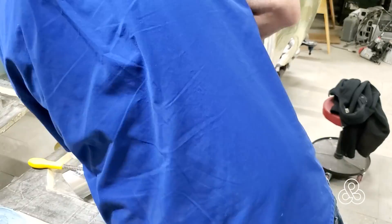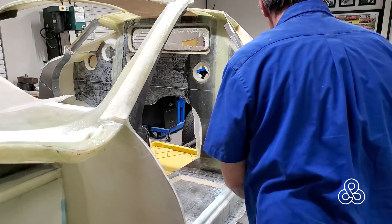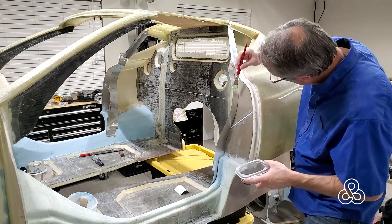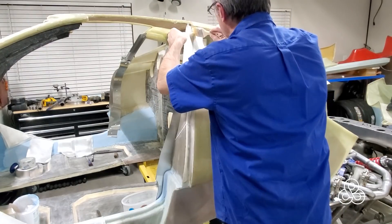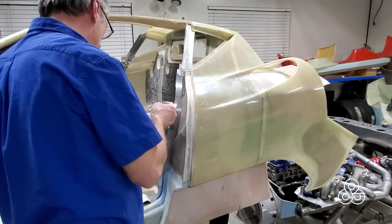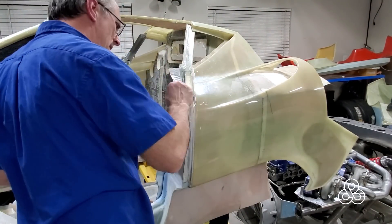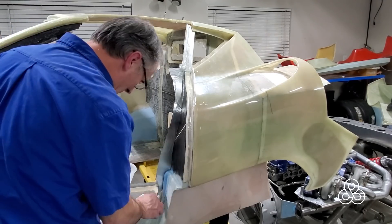Once I've got the shape I want, I peel off the Mylar tape and put the screws back in the flashing to bring it back down, because that flashing is going to form another turn-back that we want. Then vacuum everything up really nicely and put some release agent on the aluminum, being very careful not to hit any of the foam or fiberglass — I want it to stick to the foam and fiberglass but not to the aluminum. Once the release agent is cured, start putting fiberglass on — put some resin down and lay out the fiberglass using a nice twill fabric that bends well around these 90-degree turns.